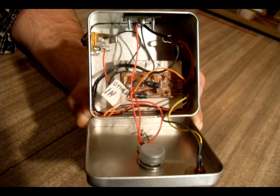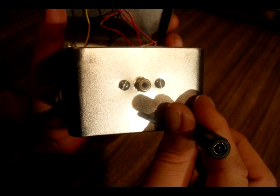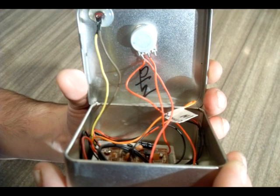The wiring was pretty straightforward — input and output. I split the output: there was a connection for headphones and the actual speaker output, and they came off the same points. The RCA goes to one and the quarter-inch to the other. There was no timer circuit on this — it's such a cheap toy. Some toys have auto-shutoff timers, and sometimes you can poke around and disable them with a low-value resistor or by connecting a switch on the unit.